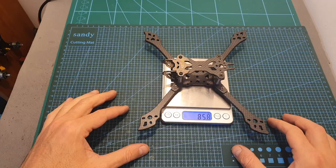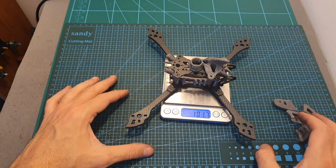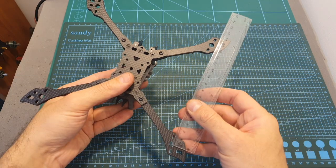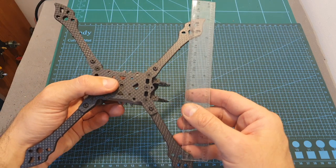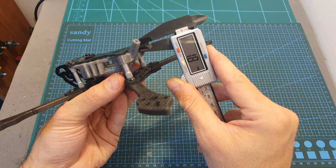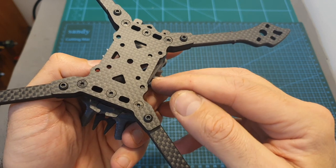The weight of the frame without the DJI-related 3D printed TPU parts is 85.8 grams; including them it weighs 95.9 grams. Including the shark fin it weighs 101.7 grams, and after adding the motor protectors it brings us to a total weight of 108.8 grams. The wheelbase of the frame is 210 millimeters. The distance between the back motors and the front ones is about 15 centimeters and between the right and left motors is about 16 centimeters, so this frame features a slightly squash X pattern. The thickness of each replaceable arm is 5 millimeters and its width is 9.2 millimeters. The bottom plate is 2.7 millimeters thick, the top plate is 1.8 millimeters thick, and the distance between the bottom plate and the bottom of the DJI air unit is 16.4 millimeters. The bottom plate features both 20×20 and 30.5×30.5 millimeter mounting holes.